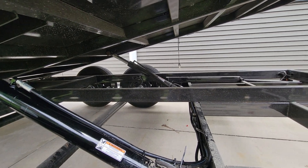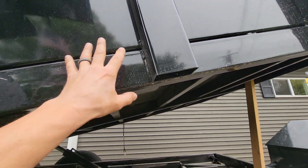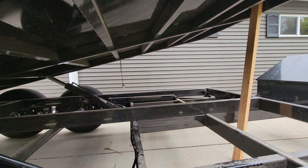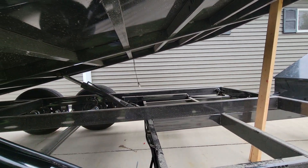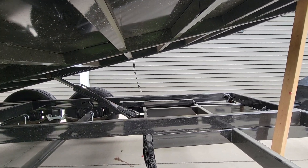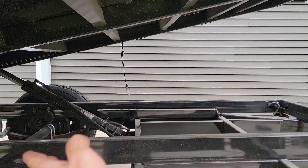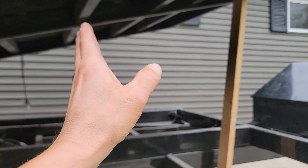Let's get into safety first. For any trailer you're working on, don't work under it — your hand is one thing, but don't reach in and work on it there. Most trailer manufacturers will have a beam like this — that black rectangle-shaped piece pivots right here, folds up, and goes under a brace. That is your safety support. Make sure that's in there.